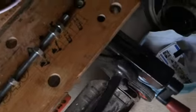Okay guys, we have got back. I've just got back, and we won't be able to make one which will fit our shaft, because it's going to have to be precise to fit the chain. So there's no way you can make one without a machine. So we're going to try to get one specially made by one of my dad's friends, so that we then have both sprockets and we can get the chain on. Because you can't find a sprocket with a 10mm diameter to fit this shaft.